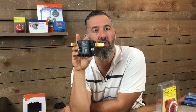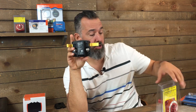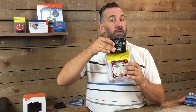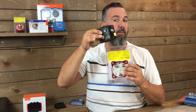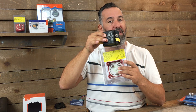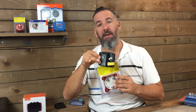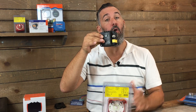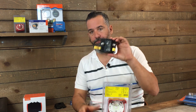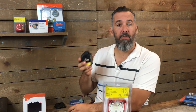So connect a battery combiner to the unswitched distribution — could be a battery switch, could be these posts right here, battery posts one and two, because they're directly connected to the battery. You can literally have an ACR just above it. But you're going to need to fuse those leads, because this is only rated for maybe 120 amps. When you fuse a battery combiner, you don't fuse the leads at the battery combiner itself — you fuse the leads at the beginning of the wires connecting to the battery combiner, because the battery is the endless source and you have to fuse both sides. That's my answer on battery combiners and where to connect them.